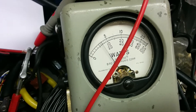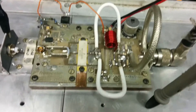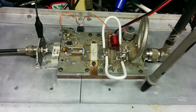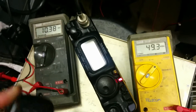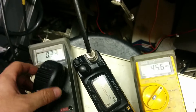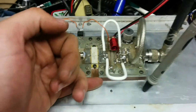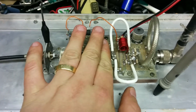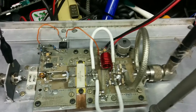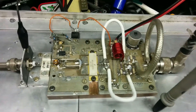That's more power than I've had it do before — tomorrow's another day. The problem is the 817 is limiting it, so we'll drop that out. It's warmed up a bit and the bias has crept up — transistors are cold off, but still. Being careful: there's 50 volts on there which gives you a poke if you forget. Occasional tingly fingers.